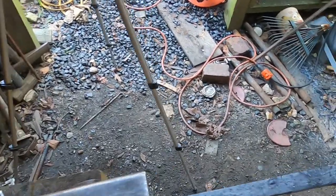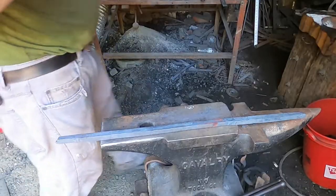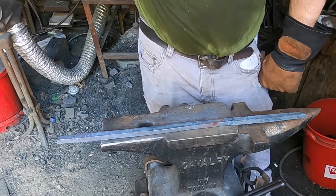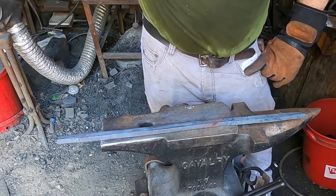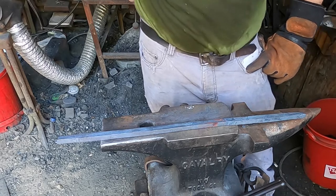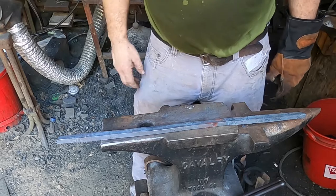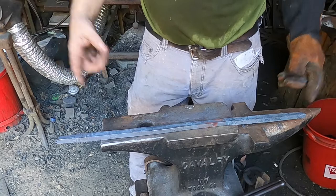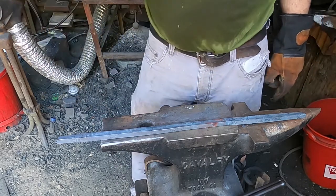But now I'm down to straightening and bringing it to half inch square. All right, so that's the central core. The keen-eyed among you will notice I've cut it off. It's a little bit crooked. I'll probably straighten that out before I totally quit on it. Actually, I know I will straighten that out. So anyway, I've cut it off to 23-ish inches. It'll give me plenty for what I need. I'll clean up the ends, both ends actually, before I assemble anything else to this.